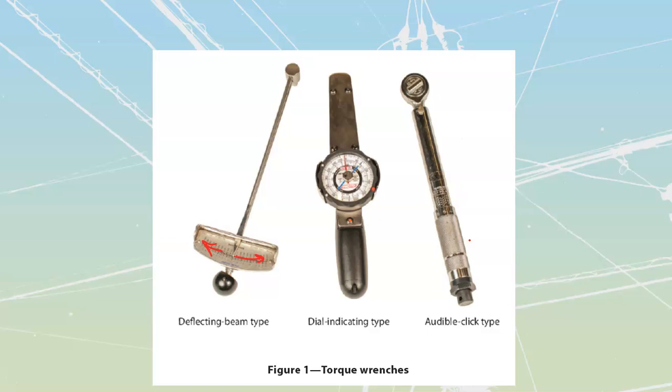Once again, though, if you don't have that information, Canadian Electrical Code, tables D6 and D7 are going to tell us about them. D6 is going to be for wire binding screws. That's screws where we wrap the wire around. Connectors with slotted screws. That's going to be ones where we drive the screw into them. And connectors for external drive wrenches where they've got a hex head. And then D6 is based on the AWG size of wire and the type of connection. D7 is going to organize torques, though, according to the types and sizes of connections. Use whichever one is going to work for the type of connector that you are looking at.